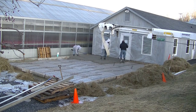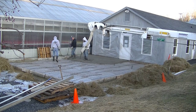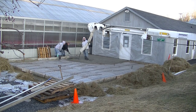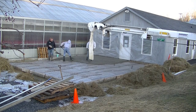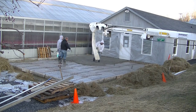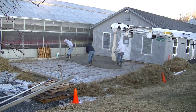I'm also using what's called a 4000 PSI concrete with three-quarter stone in this mix, and like I said it's got the fiber mesh in it — that's a pretty standard mix for us. This is late in the fall when we're pouring this. If it were the middle of summer, we'd probably just use a 3000 PSI mix, which is plenty strong enough for a regular concrete slab.